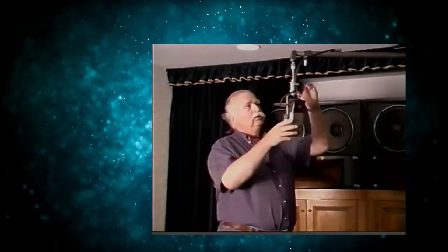There are a couple of little tricks though. If you see this mic from the side, the ribbon is actually suspended in this plane here. If you have the mic in an absolutely vertical position, the high frequency response is pretty much up to spec. But if you want to add a little bit of high frequency boost, all you do is tilt the mic this way. What happens is gravity puts a little bow in the ribbon, tightens it up, and adds about 3 dB at 10 kilohertz.